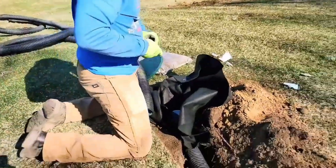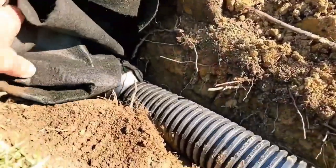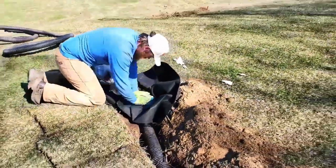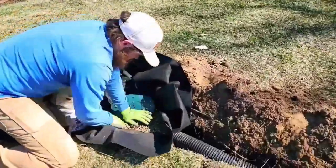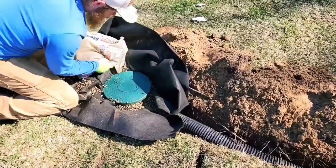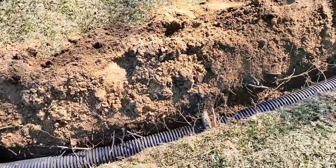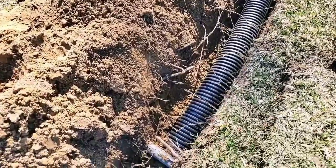At the pop-up we have a three-inch piece of corrugated pipe connecting to a four-inch short 90, so we can reach in and get tree seeds out with these big trees. We have a special fitting that takes the three-inch corrugated pipe to a four-inch PVC fitting. We drilled holes in the pop-up 90 and we're going to put peastone around it because we do not want it to hold water — tree roots will sniff out that water and try to penetrate. We set it up so the water leaches away after a rain.